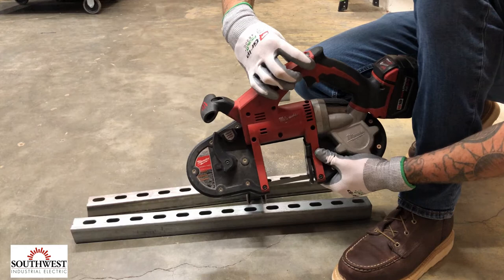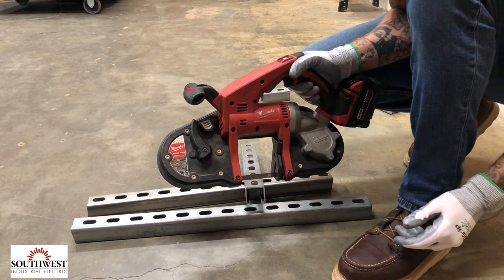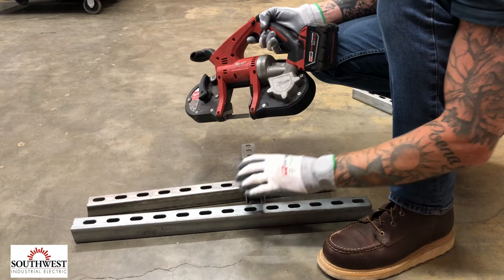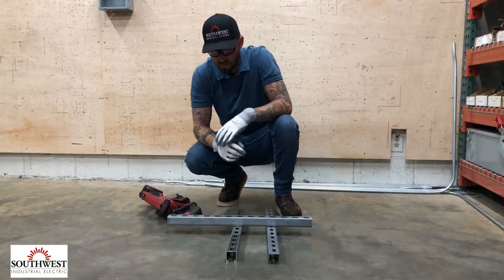You have the safety, which is usually right up here by the handle. It's a spring-loaded button — once you're ready to go, you press it with your thumb and then start the tool. If it's not pressed, nothing will happen. There's also a handle for two-handed operation. If your strut or pipe is in a vise and you don't need to apply pressure with one hand, you can hold the handle and make sure you have a good straight cut.